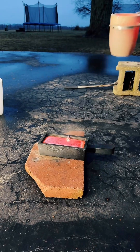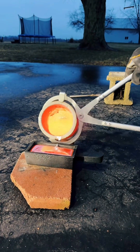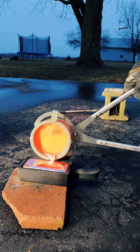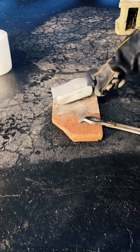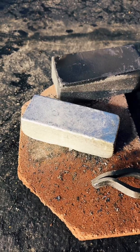It's also very important that you leave a little bit of the molten metal in the bottom of the crucible — this makes it melt things much faster when you get started again. Next, we allow the cast iron mold to cool off a little bit so we can get the ingot out. This took a little bit longer than our graphite molds. Once the ingot is out, the quench begins.